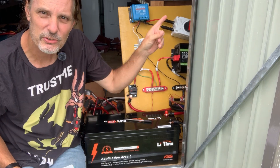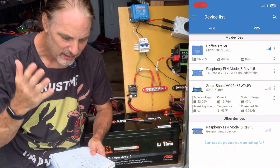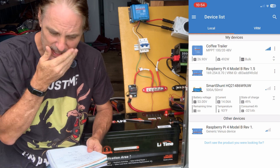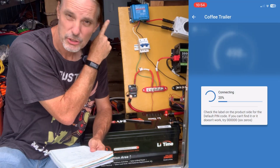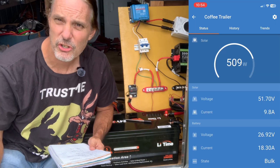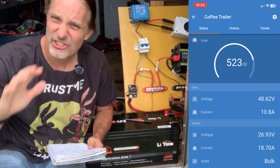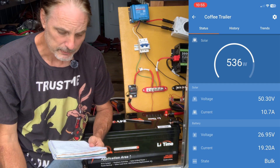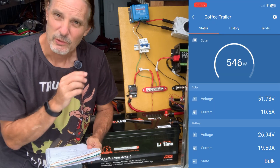Now we're towards the end of testing and I want to give a summary. I connected the battery to the Victron MPPT charger the day before — it ran all day and reached a full charge the next morning. I was charging at 28.8 volts with the 20-amp charger, and it would hit 20 amps and stay there. With a thousand watts of panels and only needing about 550 watts to charge at 20 amps, it was over-paneled to ensure a good charge.